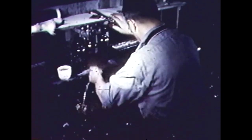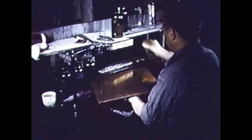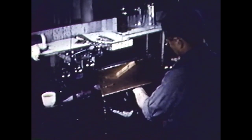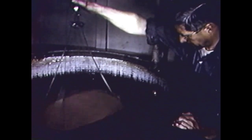Now we are ready to work with the actual plate. But first, the copper plate must be scrupulously cleaned to remove any dirt, grease, or oxidation. Washing and scrubbing with pumice helps to put some tooth in the smooth copper so that the sensitizing solution will adhere. In order to make the clean copper plate sensitive to light, it must be coated with a light-sensitizing solution. The solution used here is bichromated gelatin. It must be evenly distributed over the entire plate. For this, it is placed into a whirling apparatus. The centrifugal force spreads the gelatin in a thin film over the entire plate and speeds drying.